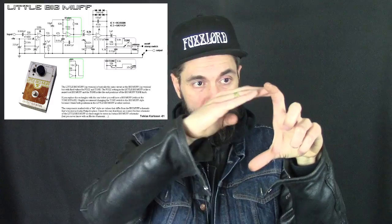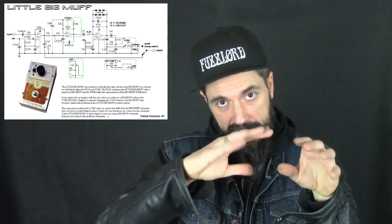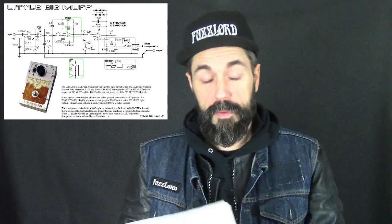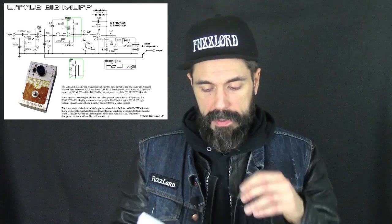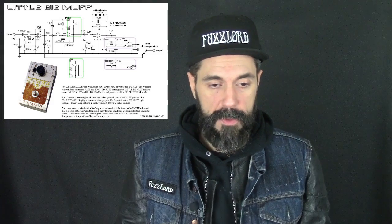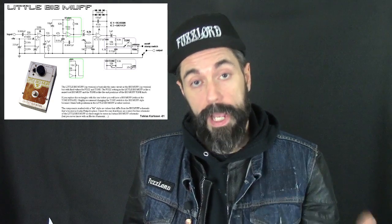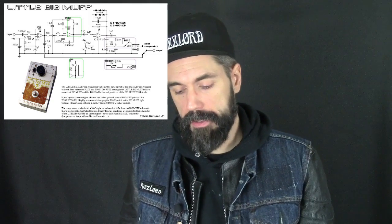So just imagine that hard limiter like on a mixing console, like a hard limiter on a DAW, you know, when you're mixing down songs. Imagine we went from 0.7 now to 0.7 times 3, so 2.1. We have a bigger amount of amplification we can do before we square wave it and clip it. Not completely square wave, I'm sorry, it's soft clipping, so it's soft on the edges. The point I want to get across is that when you have those 3 diodes in a row like that, we're going to be able to amplify it more before it clips, and that gain stage clipping is going to be way louder, 3 times louder.